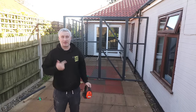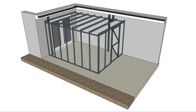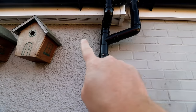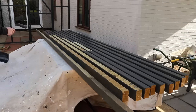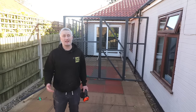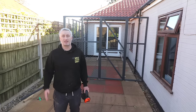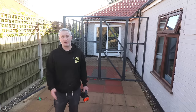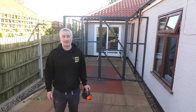I'm having second thoughts about how to build the roof. Originally I was planning to put a batten on the wall and then have joists running across in line with the wall studs — that's why I did the spacings at 530 millimeters, because then the downpipe would have fitted nicely between two joists. Then I would have added chicken wire over the top, and I've already painted all the joists in preparation. But the words of Andy at Gosforth Handyman are echoing in my head: 'Think maintenance, Keith, think maintenance.' Building a complete roof that way was going to make clearing the gutters a couple of times a year very difficult. I do have a couple of other ideas about how to construct a roof that will keep cats inside, but I want to think it through properly — so that's going to have to wait until next time. Thanks for watching.